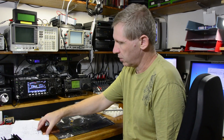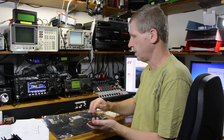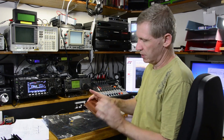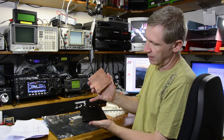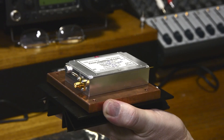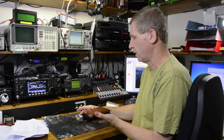The next step is to look after the heat sinking — these do need heat sinking. I've got a slab of copper here; it's quite heavy. The idea is to mill both faces so they're perfectly straight, along with milling the heat sink surface, and you basically bolt them together. The option would then be to add a muffin fan if you need to pull the heat out of it, which I think would be more than adequate.